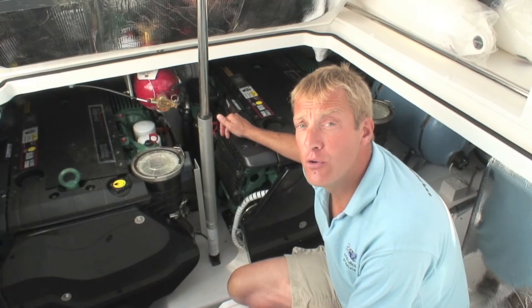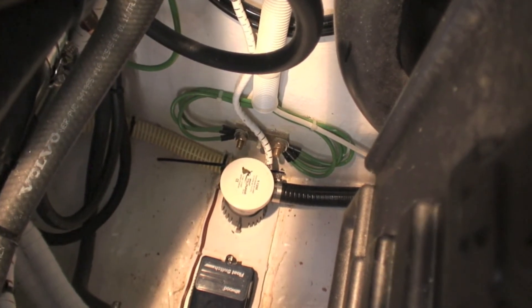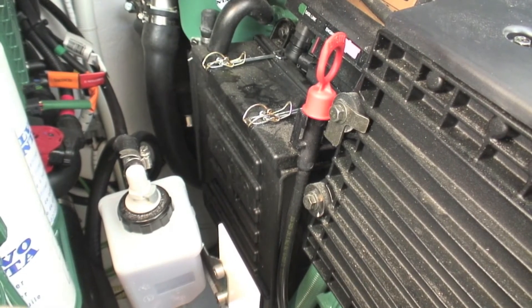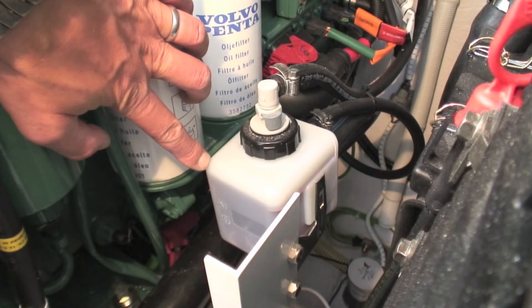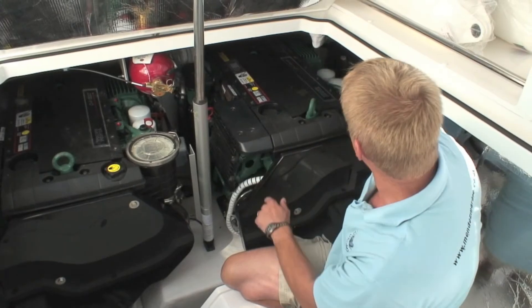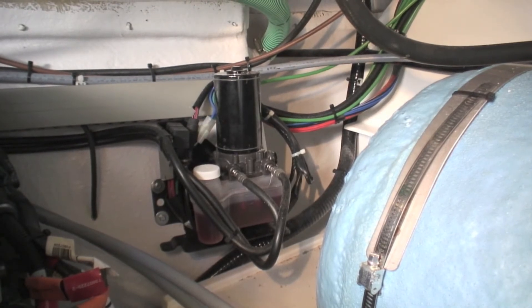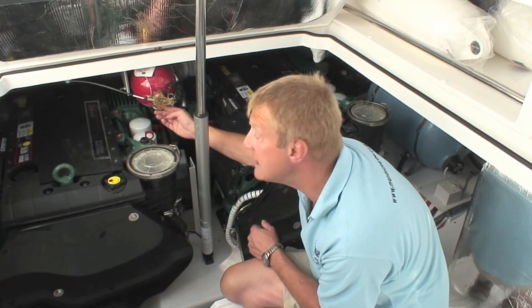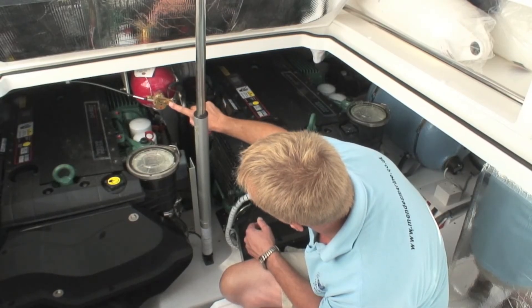Last on our list is our general look round. We're looking for a nice clean tidy build so any leaks can be spotted quickly and appropriate action taken, and then I just check the other bits as a visual once over. I've got the air filters down here just to make sure they're clean and not fouled. On this boat we've got a power assisted steering system so I've got an opaque container here with a level. On either side of these engines in the rear corners we have the trim for the outboard legs — again it's opaque and I can see the levels comfortably from here. We also have our fire extinguisher system, so it's a little glance at the gauge to make sure it's in the green, and then very importantly make sure this travel pin is removed so that if you were to pull the system from the helm it would actually work and put a fire out.